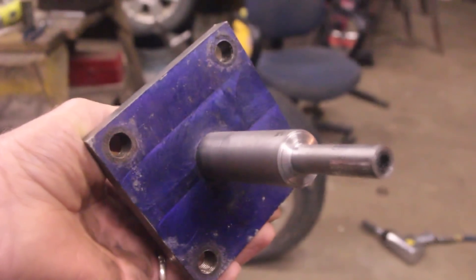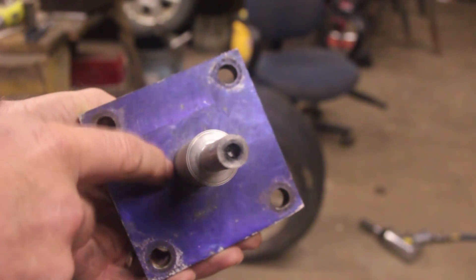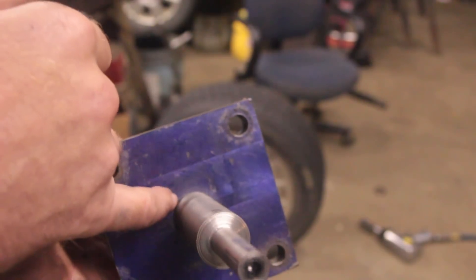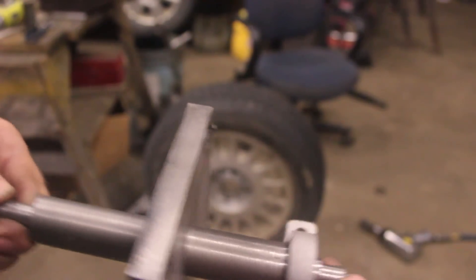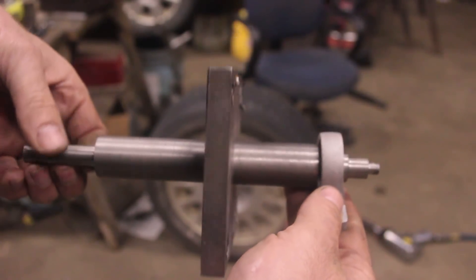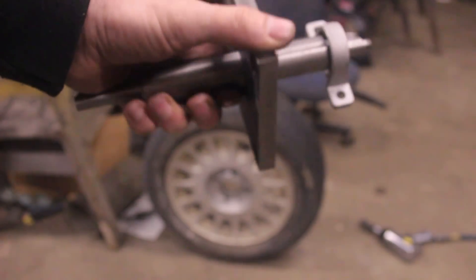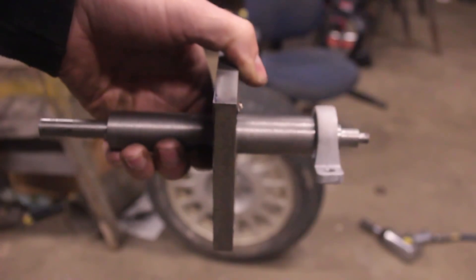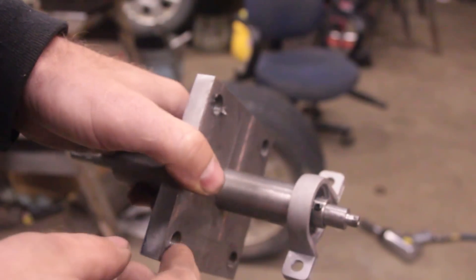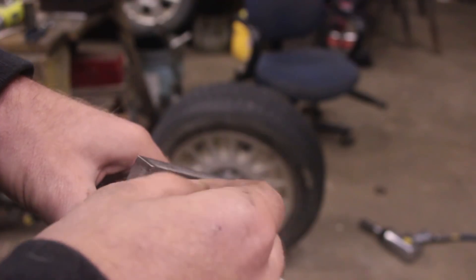I have this drive plate. I worked on this with Binary Dinosaur today - got the four holes drilled and the center hole bored. This is just a press fit onto the shaft now. The idea is there's going to be another bearing on this side, two bearings and two upright posts, and then you'll spin the wheel with a drill. This is fresh, has not been deburred yet, so it's kind of deadly.